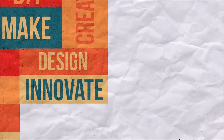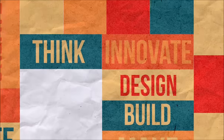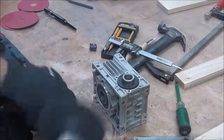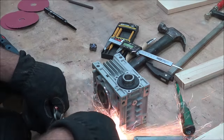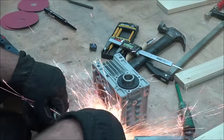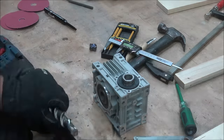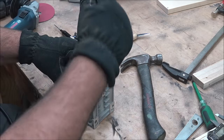Let's make something that goes zoom. In today's video I wanted to show you how I'm building this drivetrain for an upcoming build. It's a pretty simple system. I've got this gear reduction box I bought off of eBay — it's a 5 to 1 reduction, and I'm using a Bosch Bulldog. This is a 36 volt drill, so it's very specific.